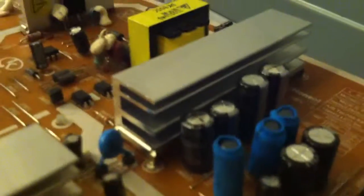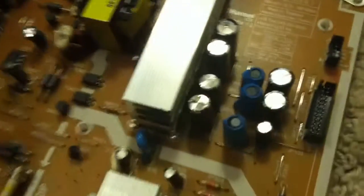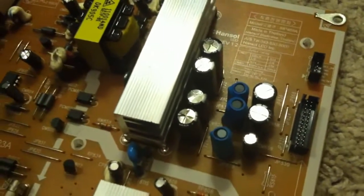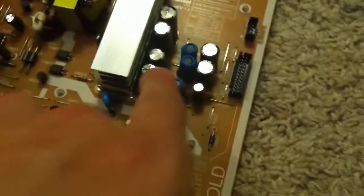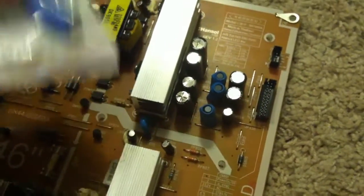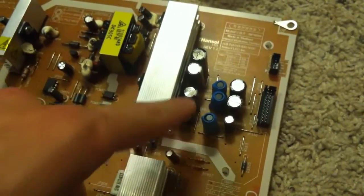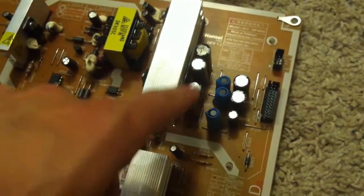They've got crosses in them, but the surface itself is flat. If you see anything like this, you see how it's got the brown on top? And you'll feel that it's curved. That one's curved, and that one's curved. I'm taking it in better light. And this is actually pop. That one's leaking, and that one's leaking. 1000 microfarad, 35 volt. Negative polarity is on the connector side. Make sure that your polarity gets put in right. Otherwise, if you put a capacitor in backwards, you'll blow that up.